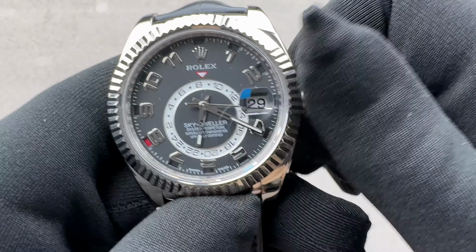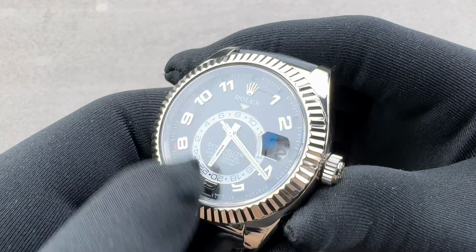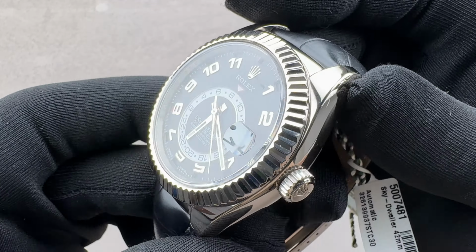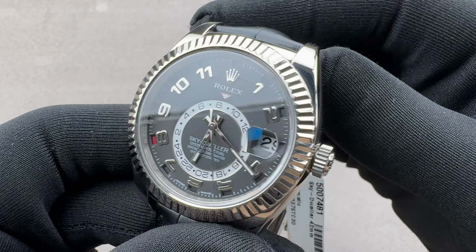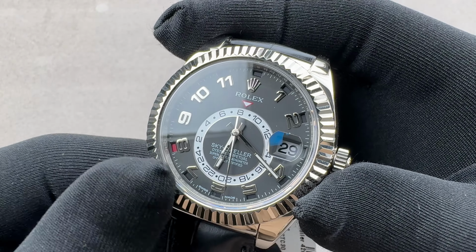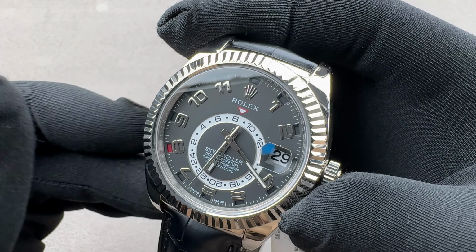The watch is automatic winding, but it has a 70 to 72 hour power reserve, which is outstanding. 3 days of power reserve, automatic winding. It is a COSC certified Swiss chronometer, and Rolex goes above and beyond that, adjusting the watch as a fully cased watch in 6 positions. So consider the COSC to be the minimum, not the maximum.